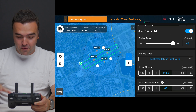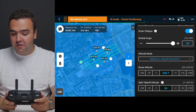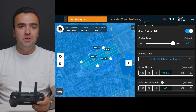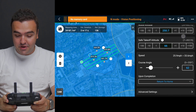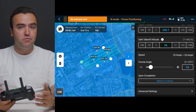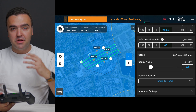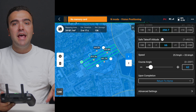For this specific flight I'm going to set a flight height of 250 feet, since I know there's some higher machinery in that area that could get in the way. I've got the upon-completion task set to return home, so once the drone is done it'll fly back. Now that we're all set up, let's go outside, run the mission, and capture our data.